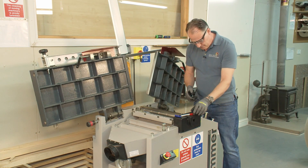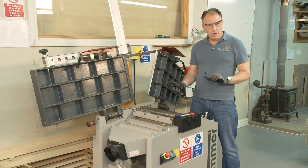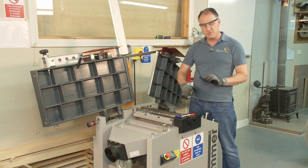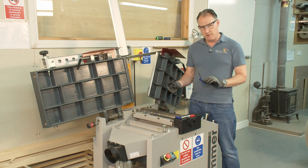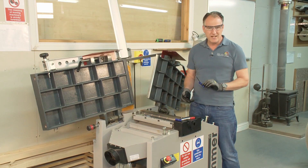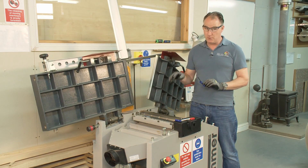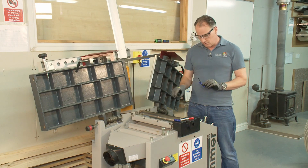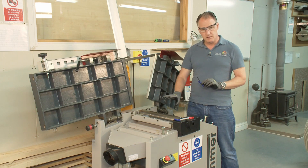These are a double-sided blade. If the other side of these blades is blunt, or the side that's here which is also blunt, I'll tend to put a black or a blue marker on them just to say they're dull, they're dead. Maybe I would use those again if I know I've got some boards which really have got the potential for lead shot or a screw in there — I don't want to be putting that kind of stuff through my thicknesser, but if I've got no choice and I think there's an issue, I won't use brand new cutters — they won't last any time at all, they'll be knackered straight away.